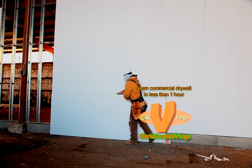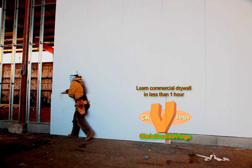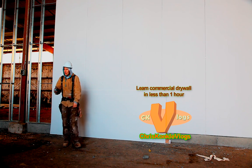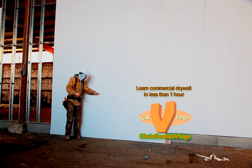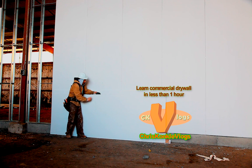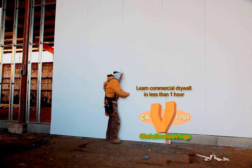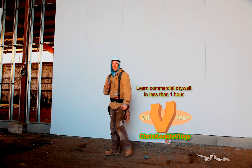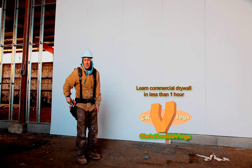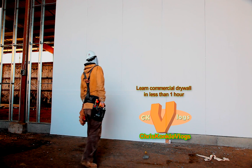When you're rasping, make sure you're rasping a little on the angle towards the back side. So you're gonna make sure there's nothing ahead of the line, only behind the line, right? So angle it in just a little bit to ensure you don't have anything past that line. Always rasp your cuts. It's good practice, especially the 5/8, you can get burrs as big as 5/8 itself and bigger.